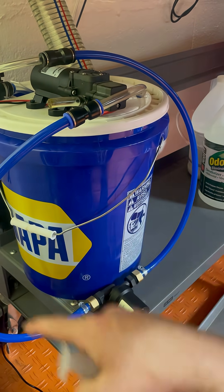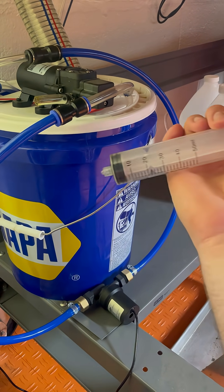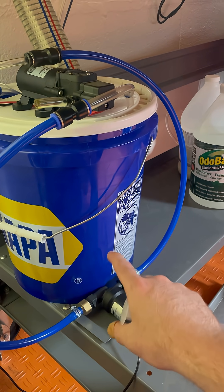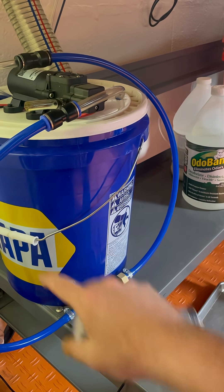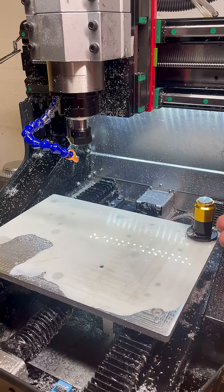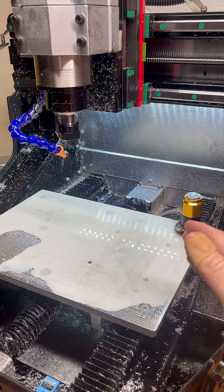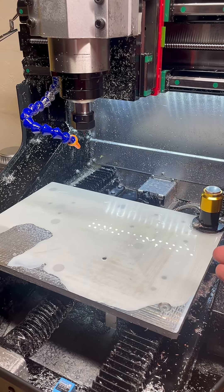So I've got the pump full of water. I just disconnected the inlet and used this syringe and about a hundred milliliters of water to fill these two lines in the pump casing. Now hopefully once it starts and I can get this amount of air out of here I'll never have a problem getting this to prime again because it'll already be primed. I've been able to run the pump a handful of times to confirm that it maintains its prime, which it does. It took a little bit of doing at first to get the prime there but now that I have it, it doesn't appear to be lost.